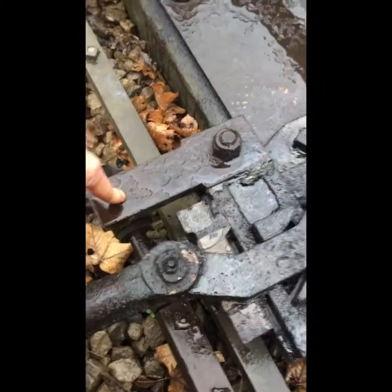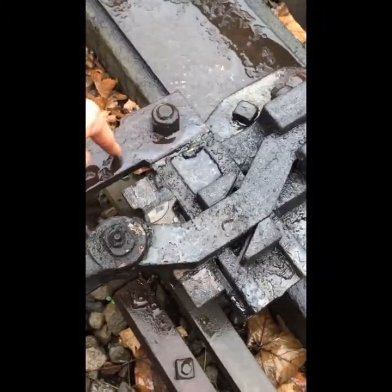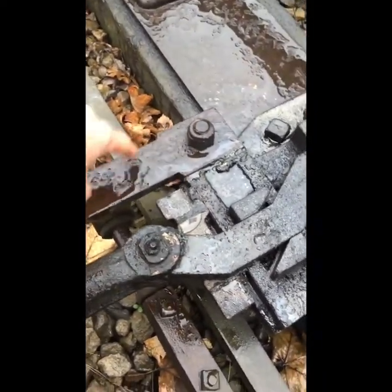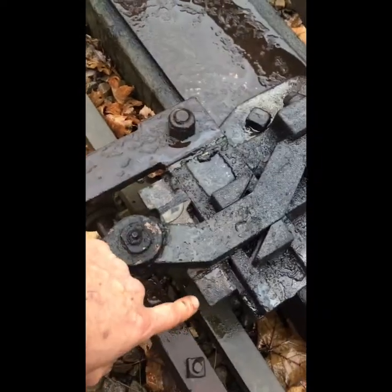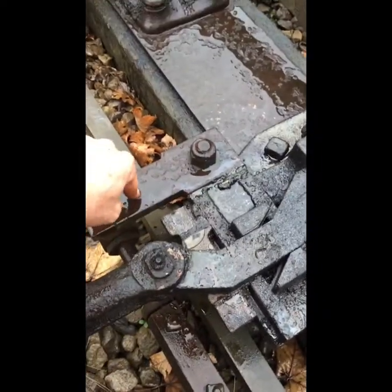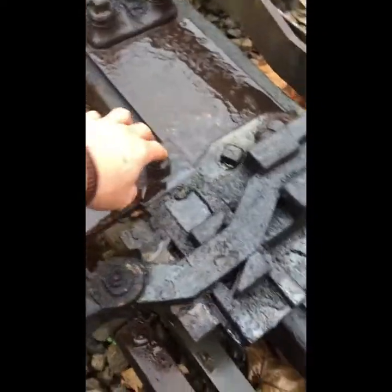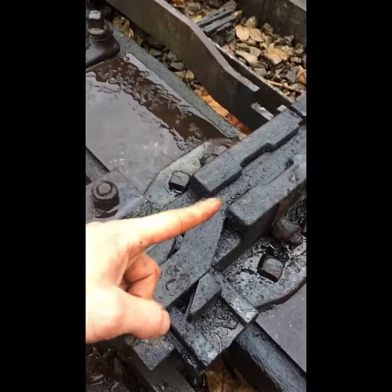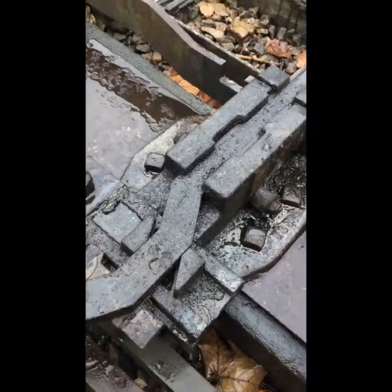The kicker has an extension plate on. When you're cutting your rods, if the rod doesn't line up and this needs to be longer, you've got the rod in the wrong position. This rod is a fixed length, so that defines which one is the FPL one. The kicker is kicked over as you unlock and lock the facing point lock, and that drives your mechanical or electrical detection.